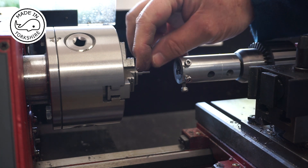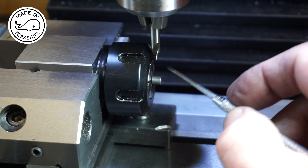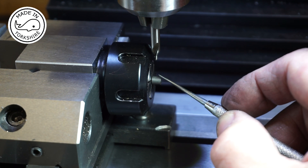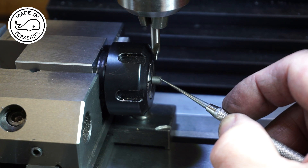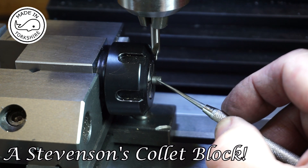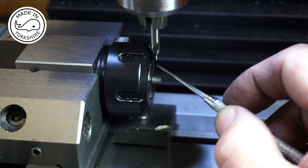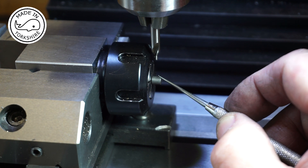I just need to part it off so it's half an inch long in total. Now I need to drill a hole through the head of this bolt. Ideally one of those little drilling attachments for the lathe tool post would work a treat, but I haven't got one. So I'm holding it in a collet chuck, I've centred it up, I'll use a centre drill first and then a 3/32nds of an inch drill bit.